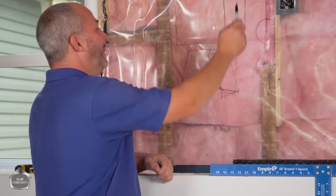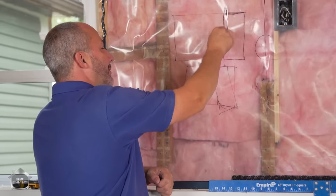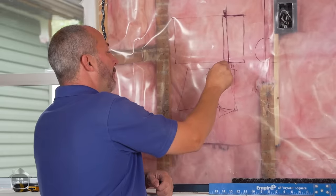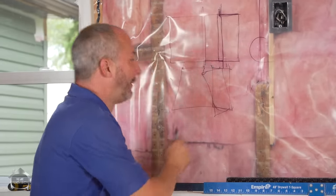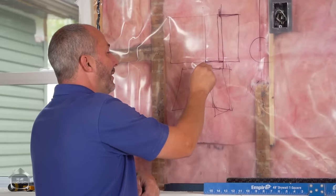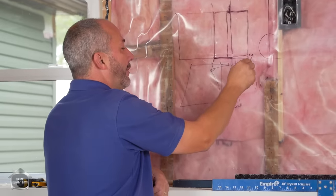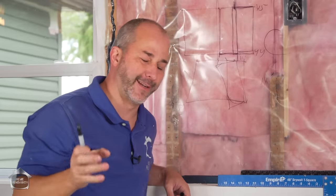What I want you to do is just start by measuring over 45 or 46 inches. Okay, take that measurement and write it on the wall. We'll call it 11 feet. Move over 4 feet. Take that measurement, okay? And then what you're gonna have is, because you're using the short side of the wall, if it's still 11 feet here to here, you are installing it square. Now, the distance here might be 44 on one side and 45 on the other side, but you can cut that because your sheet's 48 inches wide.